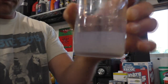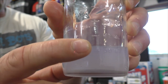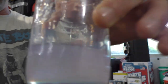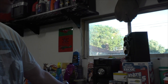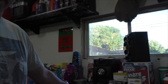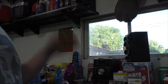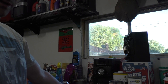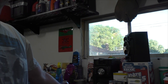You can see my mixture here — this graduation was 30, but I had about 40 milliliters, so I thinned it 10% with the styrene. That's what the mixture looks like — it thinned it out a little bit. The chart says for one ounce it's 0.59 cc's of MEKP; I'm going to put double in because I used styrene to thin the gel coat, which increases the cure time. Once I put the MEKP in I should have about 25 to 30 minutes of working time.